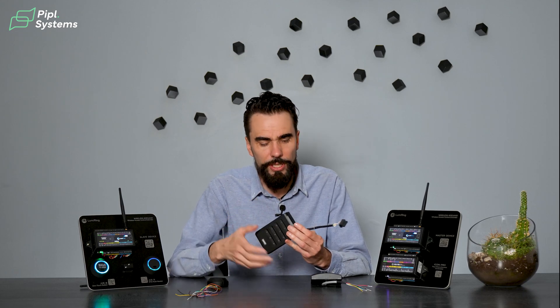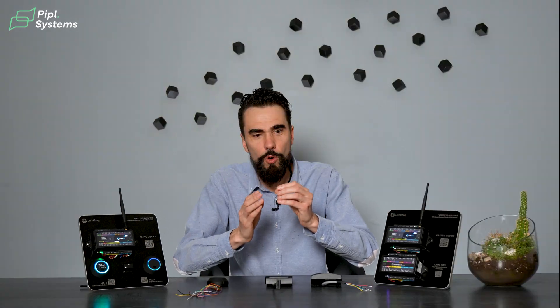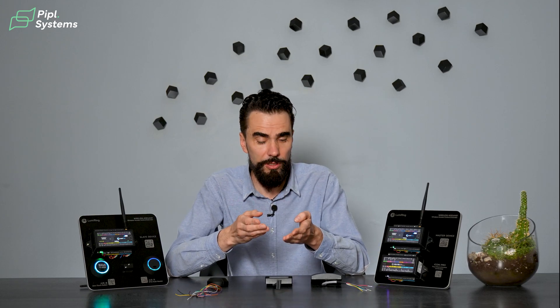But let's talk about the history. This RS485 protocol was also created for industrial use for sensors and it has inherited problems, because this is a serial protocol. Devices are connected one-to-one in series and only one device can transmit data at a specific point in time. So there is a disadvantage in that this wiring and protocol is subject to denial of service attacks.